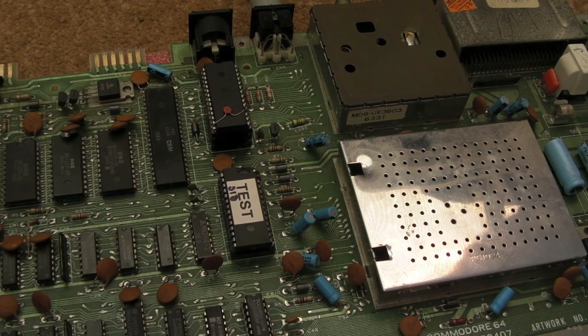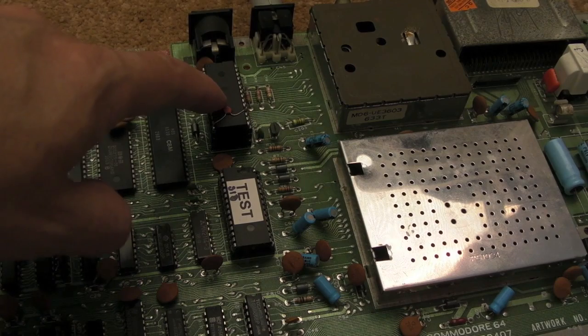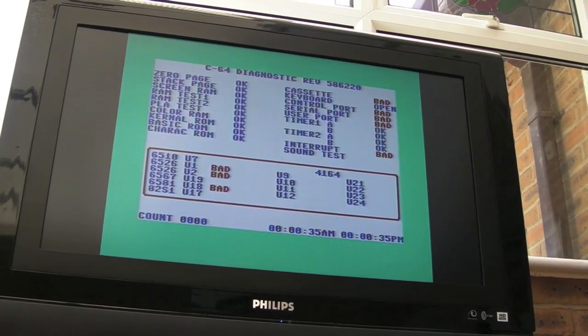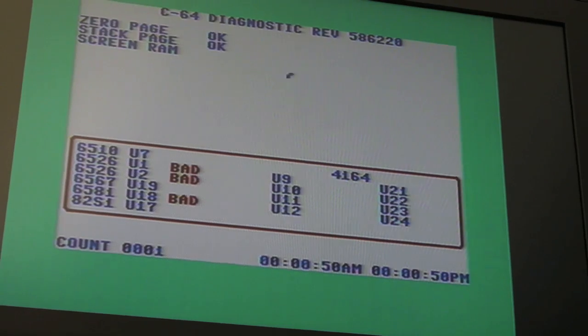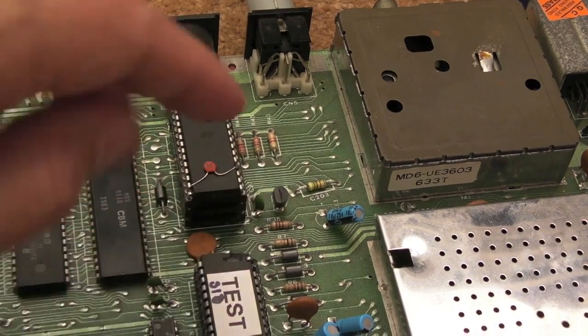Okay, well this is a few days later. I've got one of these Atmel chips — I can't quite read the part number on the top — it's something like AT27C512R. It's an OTP, 45 nanosecond speed. I've now got it working with a cap. Previously, just as default with that chip in there, I was getting RAM problems consistently every single time — unusual amounts of RAM reported in BASIC when you first switched it on. But after some experimentation, I found that putting a cap on the CAS RAM line makes this better.